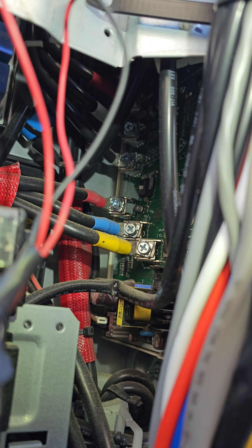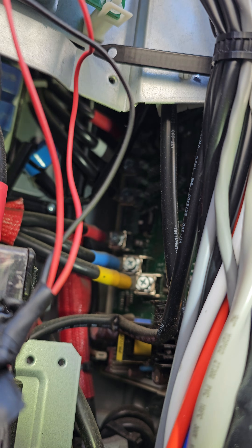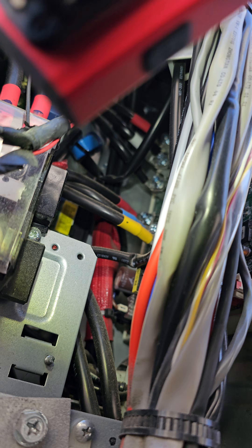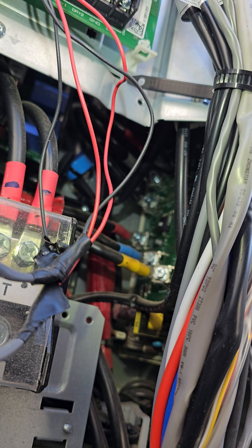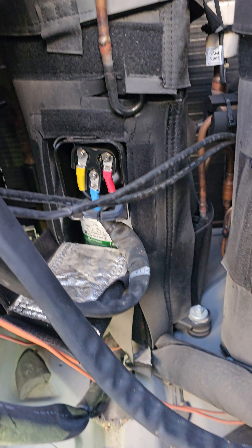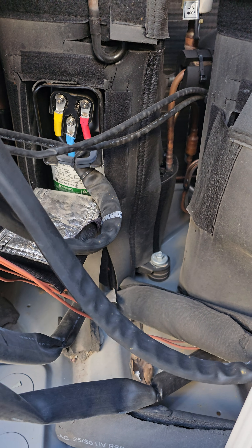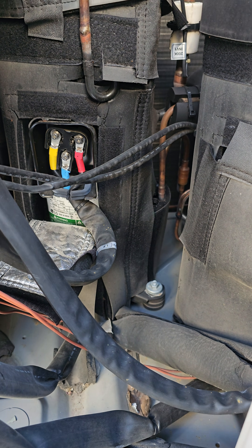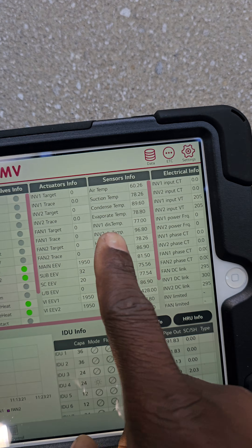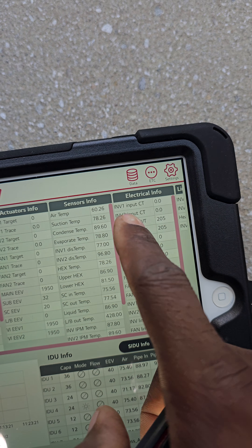If you can see in there — everything is nice and shiny over there. So all my electrical connections look good. I've got three wires in and three wires out, those are my power connections, so that's not it. Maybe the compressor is seized — I'll know because once I reset it I'm gonna have my meter on the line.